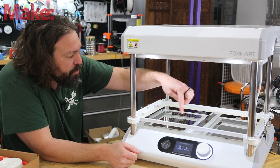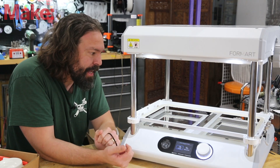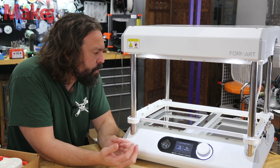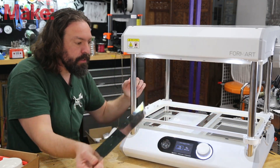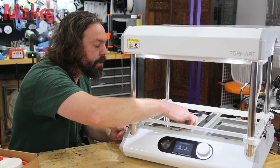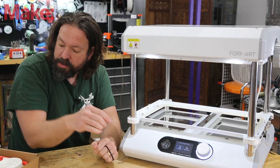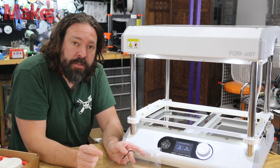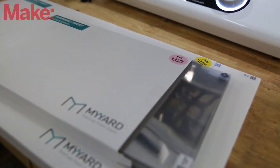The bed size on this is about 300 millimeters wide by 500 millimeters long, which is actually pretty sizable for a desktop vacuum former. One of the features that I thought was actually pretty neat is that you can change the size of the vacuum forming table to accommodate different materials that you can purchase. You can purchase materials from them directly, and it uses a handy little QR code with a camera here to automatically set all the temperature and timing and stuff to get the best results out of that material.